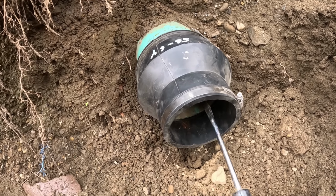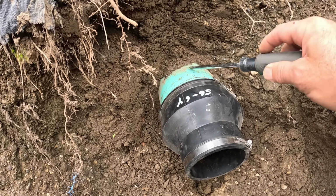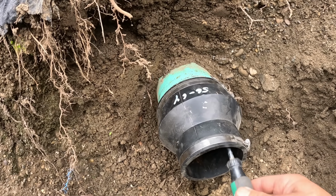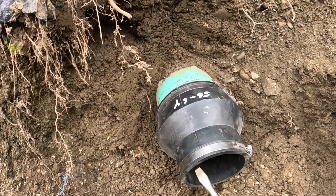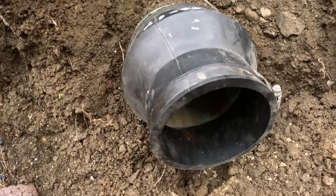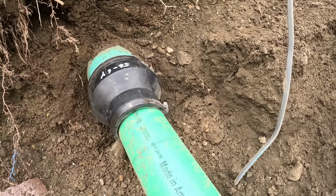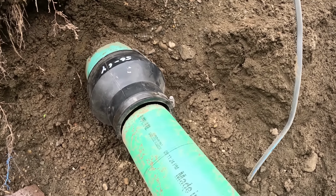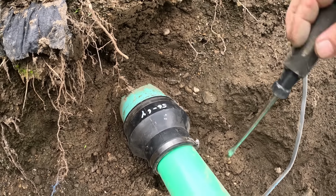But one thing I'd like to say is I take that pipe, that 4-inch, and stick it in there, go a good 10 inches in past that, in case there ever is any issue with it. You just don't want to be right here, and then that fall down. Put the other pipe inside that pipe. You know what I'm saying? So instead of just going like this, take that and go like that. So now we're in good 2 feet. We know we're good.